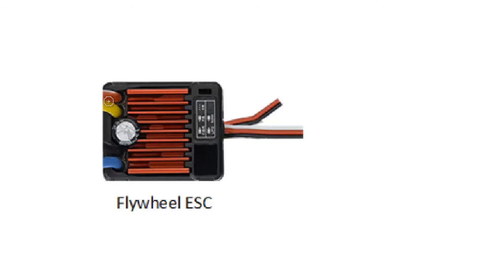So just a quick recap: the ESC I make use of basically has the red and the black, which are the connections you get power supply from the battery. Then you have the yellow which is your output and the blue is your output as well. Then there are three wires — white, red, and black. The white one is for you to control the ESC, and the red and black is basically the BEC, the battery eliminator circuit, whereby you can tap into the ESC to get a supply of around six volts.